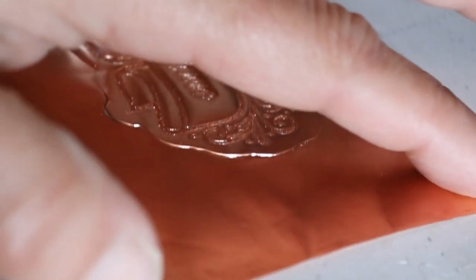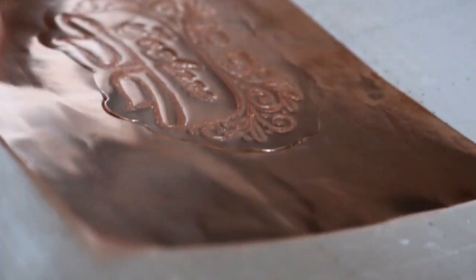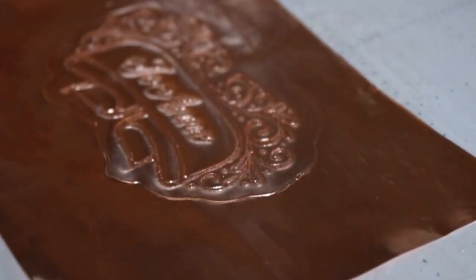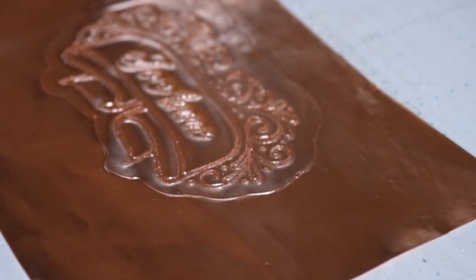So I'm going to leave it at that same depth, and I'm going to hit cut again. Okay? With metal, just like I said, I don't care how thin it is. You have to make multiple cuts, and you just seen and heard why. This is my deep cut blade. Yep, this is thin. You just heard why. Because it is heck on your material, or on your blades.